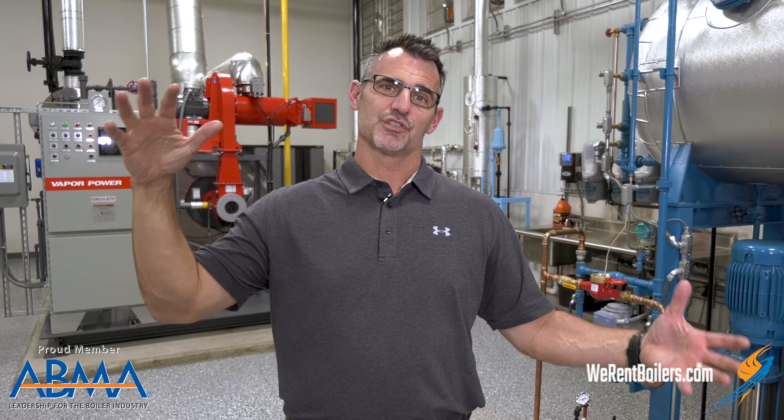Commercial producers use this by having a large steam chest or steam cabinet, and steam is directly injected onto the product as it goes through. A key benefit: water blanching produces one to three pounds of product per pound of steam, while steam blanching produces six to eight pounds of product per pound of steam, making steam better.